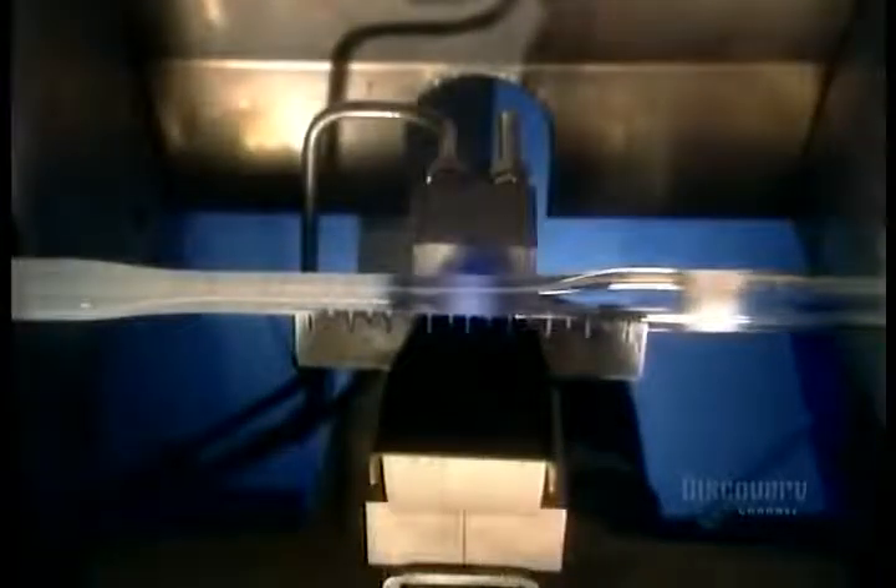When there's enough fused soot, they turn up the heat until the soot itself turns into glass. Then they heat the glass tube enough to soften it, as well as the new glass inside. The intense heat eventually makes the tube collapse on itself to form a solid rod.